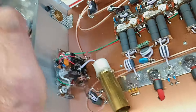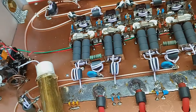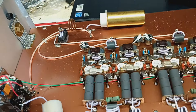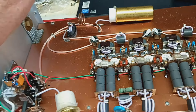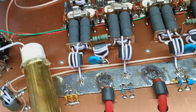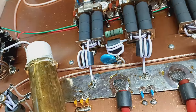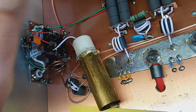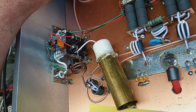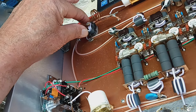It's a very nice build, just some things I feel like there should be a balance resistor here for sure. Never seen one without a balance resistor - that could just be something that was forgot. I guess this is a preamp switch. So I'm going to replace the preamp, fire this up, and first I'll fire it up without a balance resistor, then I'm going to put a balance resistor on it.